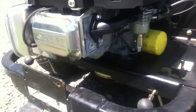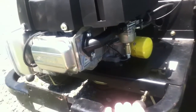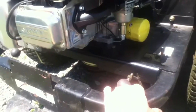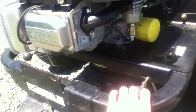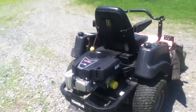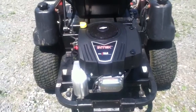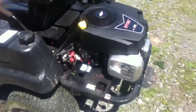You can see there's a little bit right there. The reason why is if you ever have to take this off and it seizes up on the shaft, it's terrible. You wind up destroying the pulley and sometimes even end up cutting them off. If you put anti-seize on it, it usually just slides right off like the day you put it on. So even if it had anti-seize on it from the old motor, wipe out the old stuff and put some fresh stuff on — it'll really take care of you.